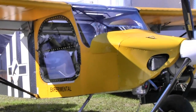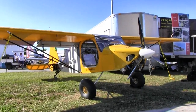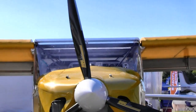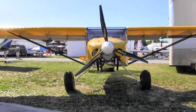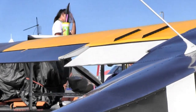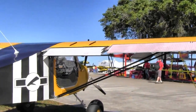You just lay the big bulkheads down over a sheet of metal on the bottom and start gluing together. When the glue sets you can flip it over and run your rivets easily. For a guy who's built an airplane before, although we're using honeycomb it'll feel very much like putting together a Zenith — the same monocoque aluminum shell for the fuselage, but instead of stamped or formed aluminum formers, we're using precision CNC-cut honeycomb formers. The whole build process will feel very conventional.